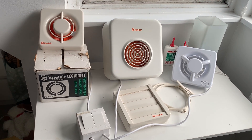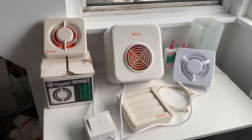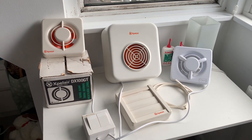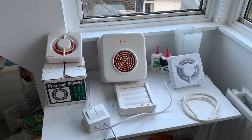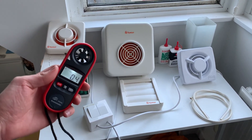These were very popular in interior bathrooms with no windows, because if you've not got a window in the bathroom, the chances are you may not have an external wall. It might be somewhere in the house where it's quite difficult to get air out. A longer length of ducting would have been required, and the sheer amount of air that can be shifted by centrifugal fans would still be enough to push the grills open. Whereas a simple through-the-wall axial fan in a longer length of ducting wouldn't have nearly enough airflow to open the gravity grill.